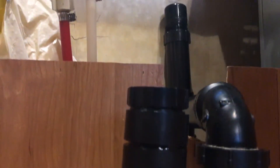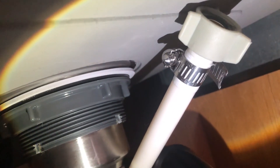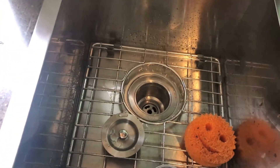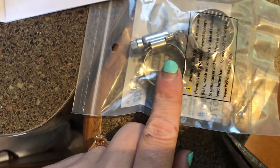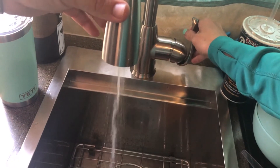Now to the sink part. Hours and hours later, plus some sleep and two more trips to the store, we still have a leak — this little bugger right here. I cannot for the life of me figure out how to get it tight enough. The hot works just fine. I got new clamps and added plumber's tape on the inside and outside — it's like my last effort. After this, I have no idea what to do. I double-checked the pipes, they're secure, and we drained some out of the bottom and nothing leaked. What I didn't capture was that all I needed to do to stop the leak was get smaller clamps. They're the exact same kind, but I thought they were too small and turns out they were exactly the right size. That actually stopped all of my leaks.